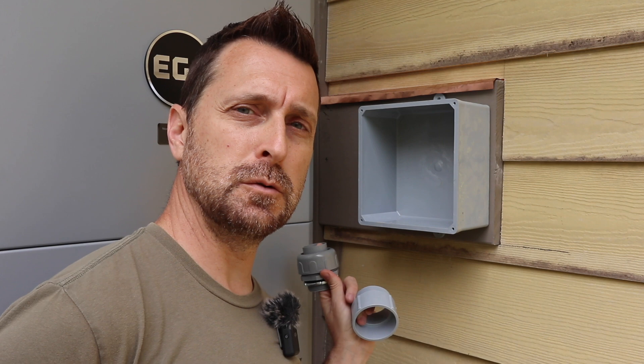Some of you who are computer programmers and use the Raspberry Pi might be able to get it to work. Now comes the nerve-wracking part, which is drilling a hole through your wall. We are going to use 2-inch rigid conduit. We have 1.5-inch flexible conduit that I'm going to run from the bottom of this exterior box to the bottom of the Flex Boss. That will accommodate my battery cables coming from the indoor wall mount batteries and my AC out from the Flex Boss into my sub-panel in my solar room. Let's start drilling.